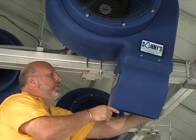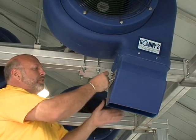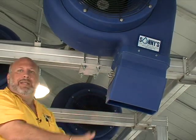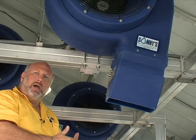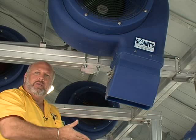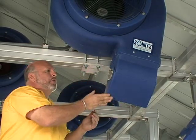This unit is set up right now at the speeds we plan on running — about 120 cars an hour — so we've got it almost straight down. The faster we go with the car, the straighter angle we can have with the air dryer, as the speed of the car becomes our angle. If we were only running a 60-car chain speed, we might put it at 28 degrees.